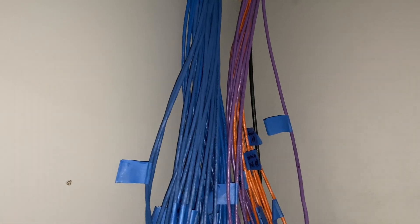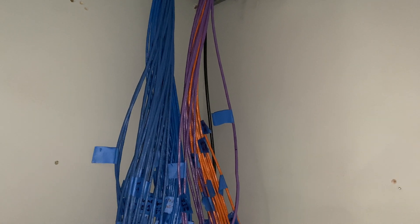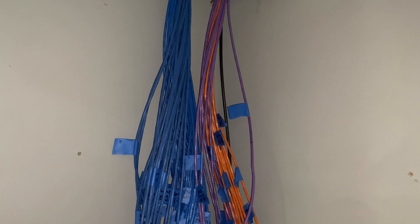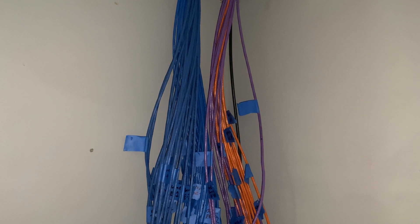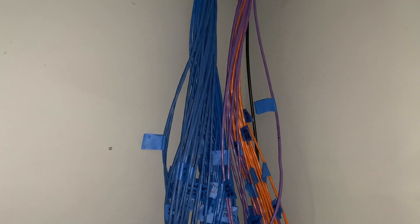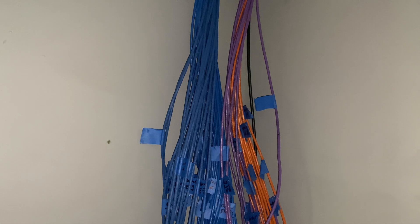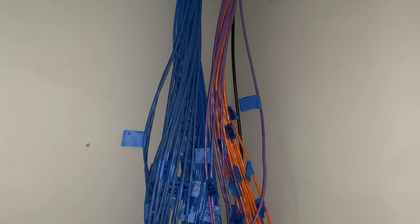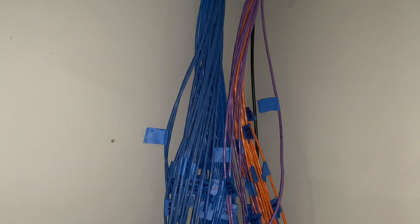The purple is security. I'm going with Ubiquiti equipment and planning on using Ubiquiti security cameras. Ubiquiti has a very nice tool at design.ui.com where you can upload your floor plans, set the scale, overlay different wall types — drywall, brick, stone, wood — and then drop in access points to see how wifi signal propagates on both 2.4 GHz and 5 GHz spectrums. That's really cool for optimizing wifi placement, so I did exactly that and placed my access points accordingly to get maximum efficiency.